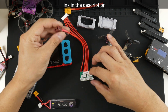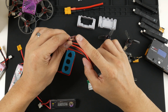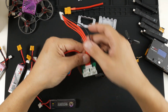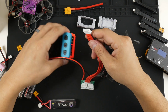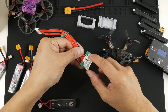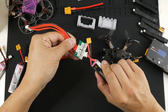What we have here is a board with a Deans T-style connector that goes out to these connection points. It has a 6S balance connector that plugs into the charger, and that allows you to charge either two 3S batteries or three 2S batteries simultaneously.